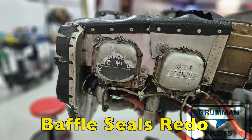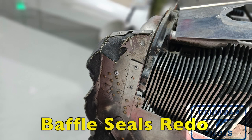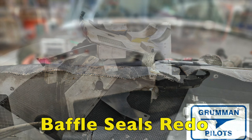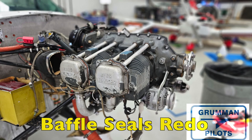While the airplane was in the shop we also did the baffles and baffle seals on the engine — it's going to get a lot better cooling. A lot of the original baffles were factory original, riveted in, and on one side they were all stapled in. We took the baffles off, cleaned and inspected everything, replaced what needed replacing, then primed and painted everything before adding the new baffle seal material. In our aircraft it's very important to take care of the seal up front under the nose bowl — it wraps around the front and lets a lot of air spill out that should be forced up through the cylinders.